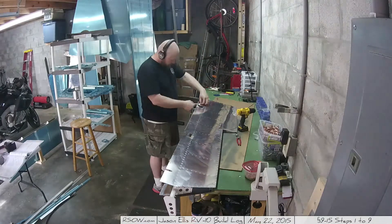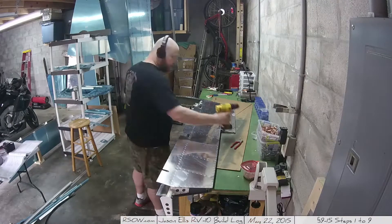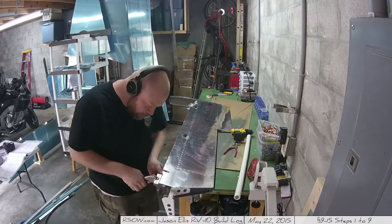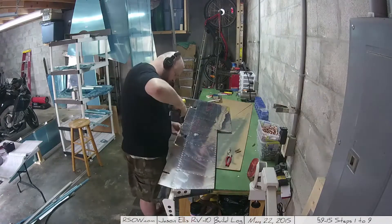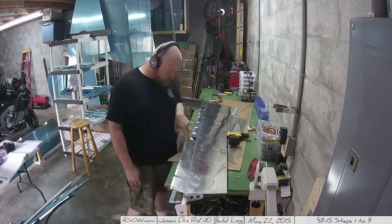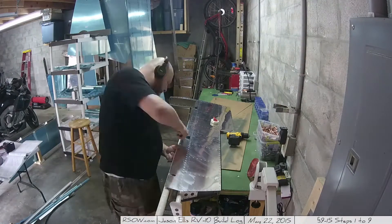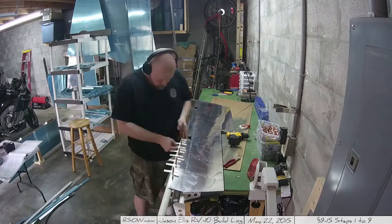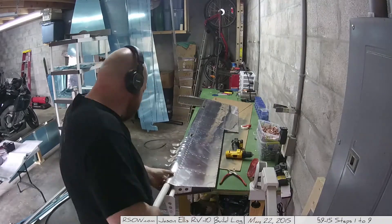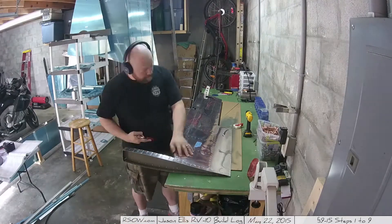As with all things, once you're done with one you go to the other. Same process both sides — didn't really learn how to streamline it or make it more efficient. I found that bending the edge down really did help things greatly, making the edges come together more smoothly. Don't feel like you're going to overdo it — I put probably a two or three degree bend in these and that came out perfectly. I did a lot less on the rudder and I don't think it came together quite as nicely, which is why on the rudder I used extra pop rivets to help with the pillowing.